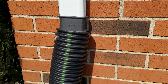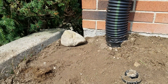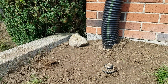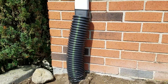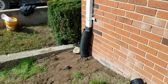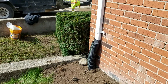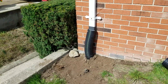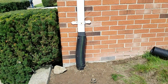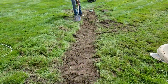This did a lot of damage prior to installing this system. You can see this concrete retaining wall had shifted — there was a lot of erosion — and the foundation damage alone was going to end up in the tens of thousands of dollars. We put some drainage fabric between the building and the wall that had shifted, packed some dirt in to get the right elevation and slope, so that the water would run away from the building to our NDS catch basin out in the lawn.